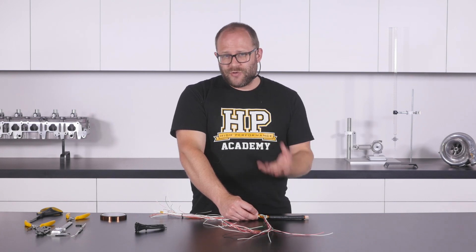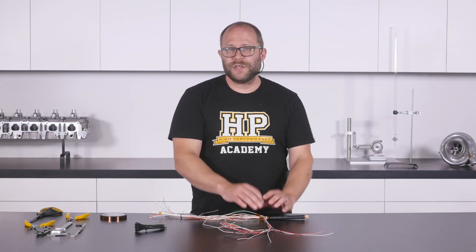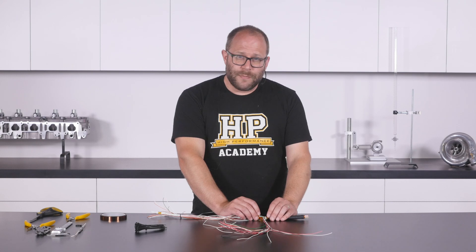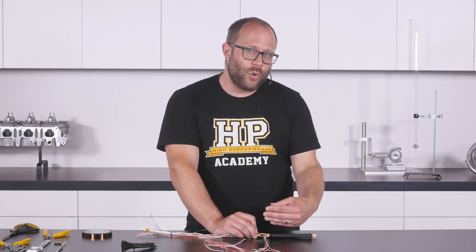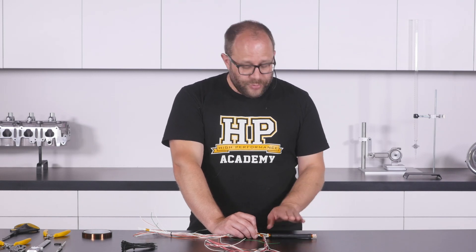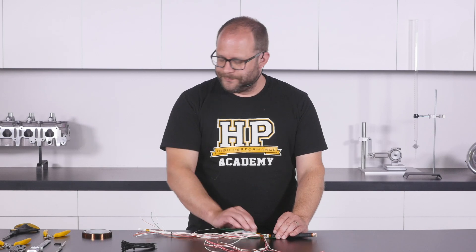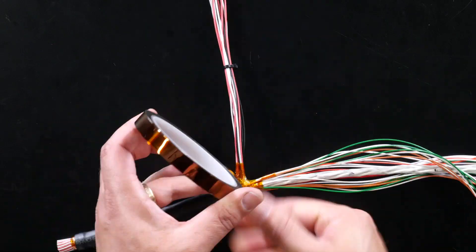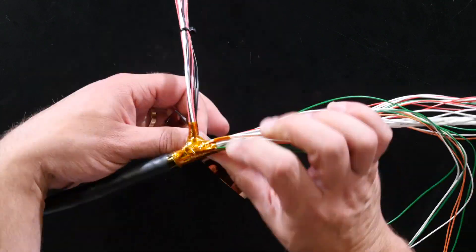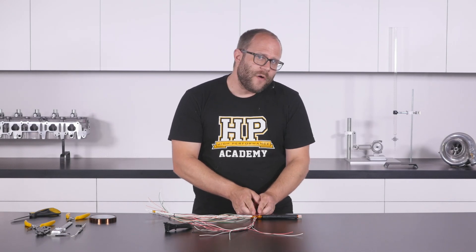With everything in the right orientation, we're going to wrap this entire branch point with Kapton tape. This serves two purposes: it's going to help strain relieve it so we know it's going to be reliable, and then when we sheathe this section and recover our moulded boot shape onto it, it's going to protect the wires from coming into contact with the adhesive lining, which will make future repairs possible. When using Kapton tape you will notice it's not particularly flexible, and as we are going to be wrapping it around corners it's not going to lay nice and flat — don't worry about that, you just want to make sure you have complete coverage to seal those wires away from the adhesive on the inside of the shrink boot.